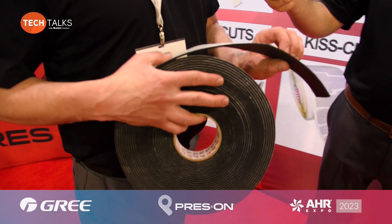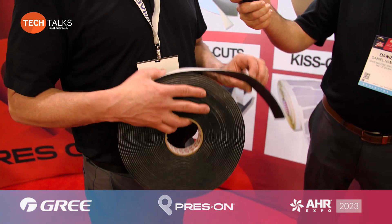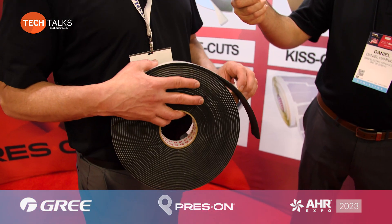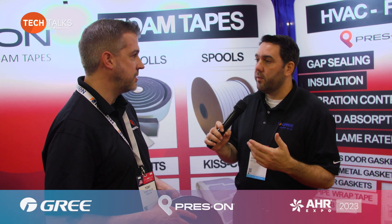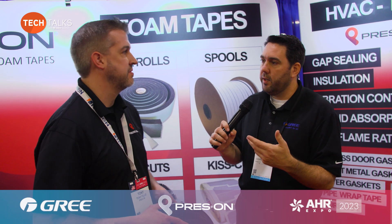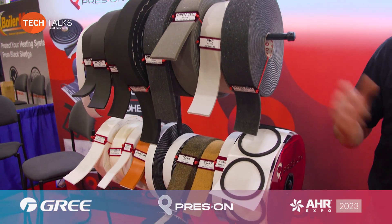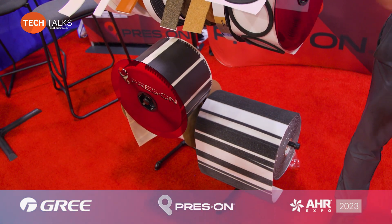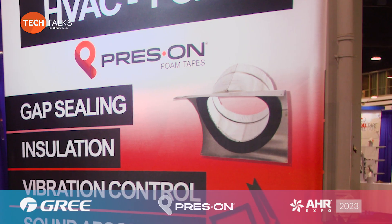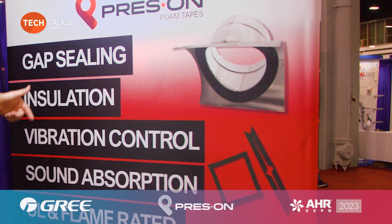The foam can be aligned against sheet metal or against a filter to get a nice airtight seal, and also for weatherproofing applications. We also sell a slim duct system, and if it's in an unconditioned space it needs some insulation. We offer a variety of different materials — open cell foams like polyurethane, neoprene, closed cell, EPDM — in a variety of thicknesses for good insulation properties. It would also help with different sounds and rattlings.